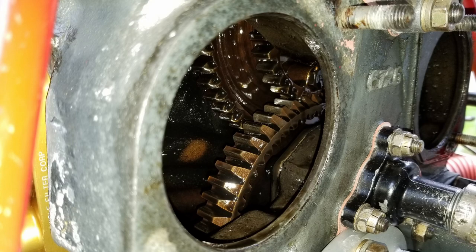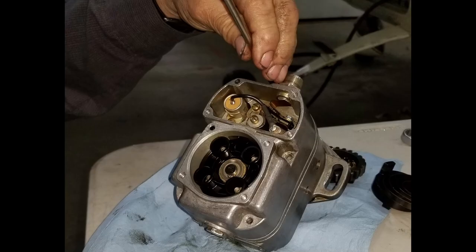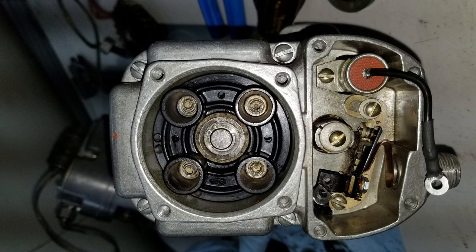This is the rear of the crankcase, and the two magnetos go into these two spots here, and they're gear-driven. And those got overhauled by my mechanic. They've got to be overhauled every 500 hours. And I was surprised and excited to find out that basically these are like distributors on an old car. On the V8, on our 65 Dodge when I was growing up, these just reminded me of that. They've got a cap and points and a condenser, so really just like a distributor on an old car. So that was kind of fun to discover.